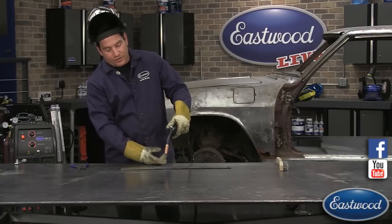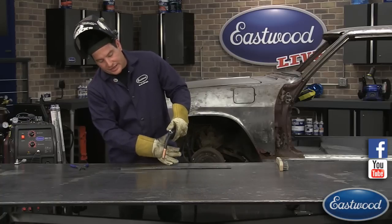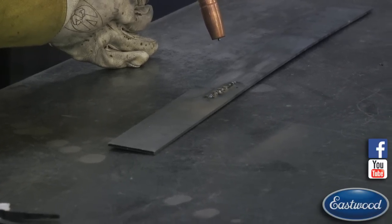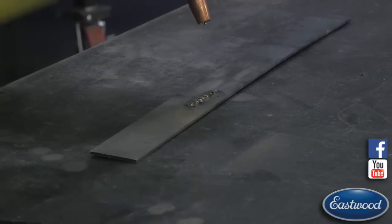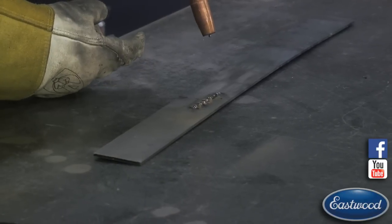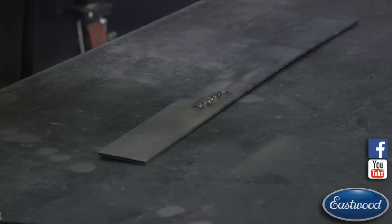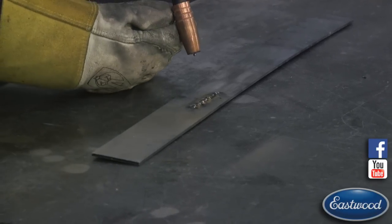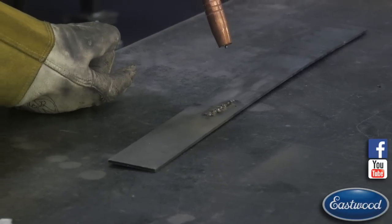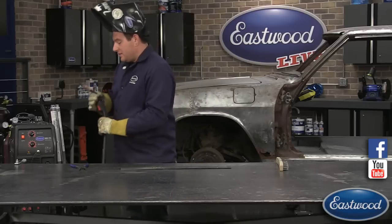So I've seen it where you want to be down pretty close to the workpiece where you're almost touching the nozzle. But I've seen guys and gals that hold their nozzle way up like this. So you're actually losing power. The resistance across that jump is so great that you're losing that power. It's the same as if you put a long extension cord on your MIG welder, causing the same type of thing. It's dropping the power of the welder and causing the same type of thing to happen. So those are the two things that could cause that.